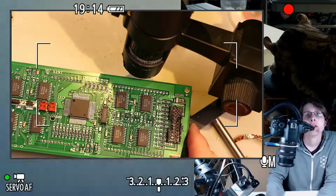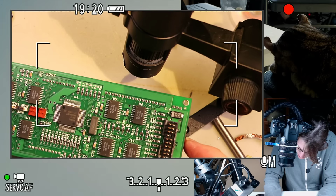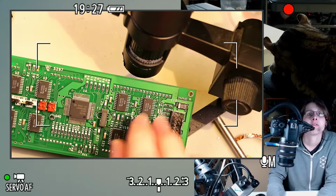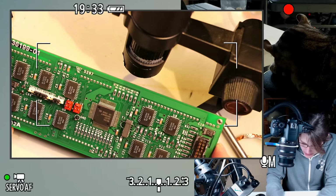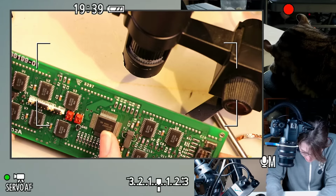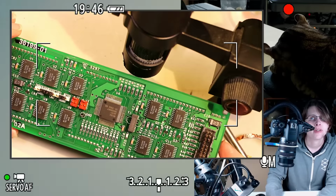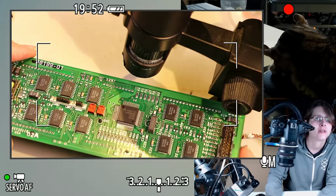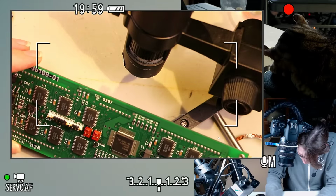So on the back, that's the connector everything comes in over. I think these are pull-downs just for all the digital IOs, or pull-ups or something. So clearly we have an array of these identical VFD driver chips, and then kind of one main driver which probably does all the fonts and everything else and actually has all the smarts in this thing. It's probably got a microcontroller in it of some kind, probably in the same category as the Hitachi HD44780 that runs most of the parallel character LCDs. In fact, I think this has a mode where it's compatible with that.